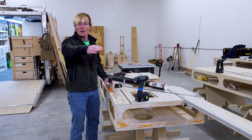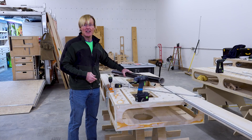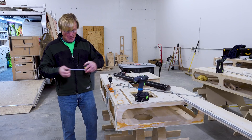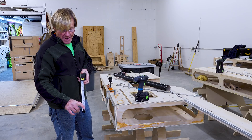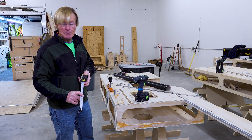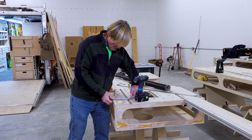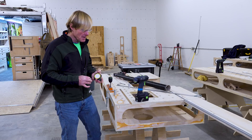The guys at PARF guide say it's near CNC accuracy - I say it is CNC accuracy. Every way I check with my FastCap tape measure, which has metric and imperial on it and the layout for the 32 millimeter system, I'm able to check every one of these holes in every direction, square them, and no matter how I do it, it's perfect every time.